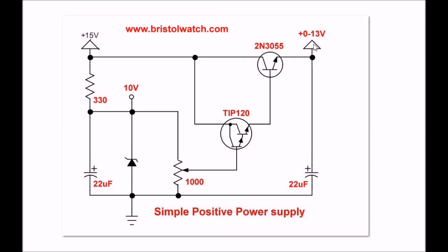Remember: measure your voltage and adjust your pot. This will go all the way to 0, but it doesn't work perfectly at 0 — the potentiometer is essentially grounded. No current will flow into the base of the TIP-120, thus no collector-emitter current, thus no base current for the 2N3055, and you get 0 volts.